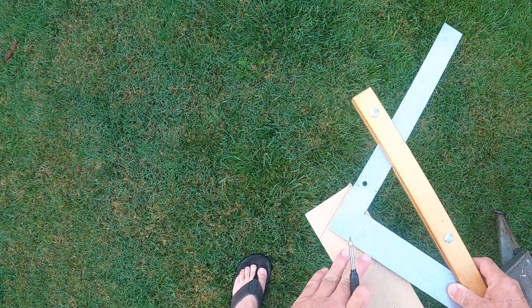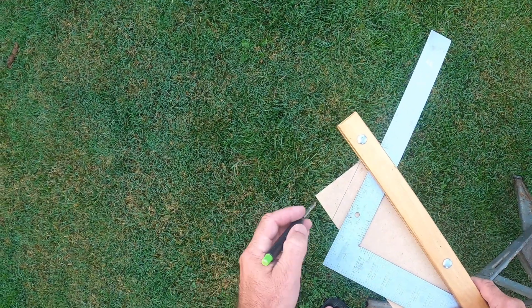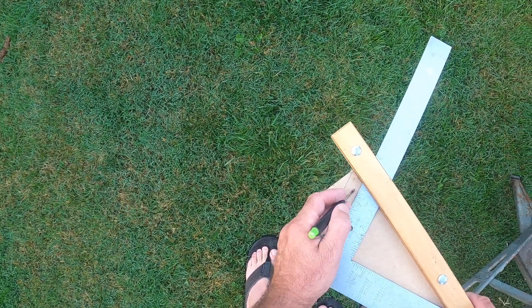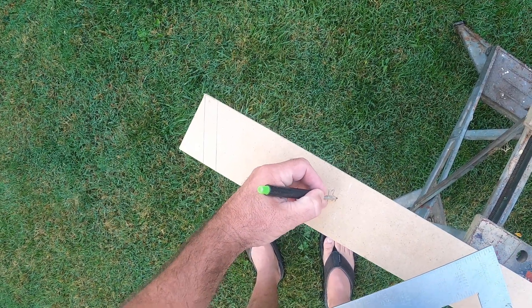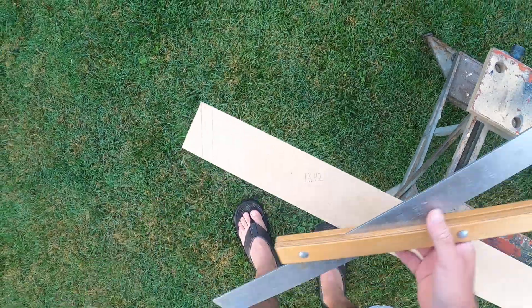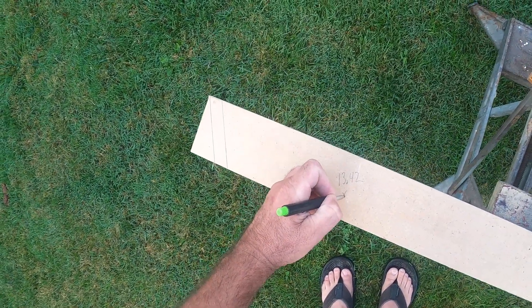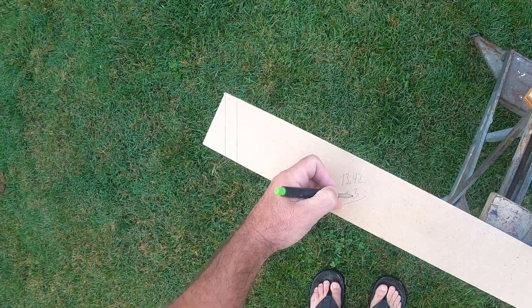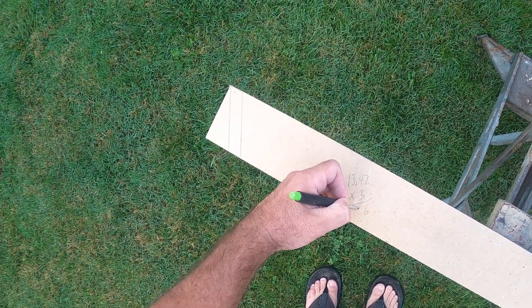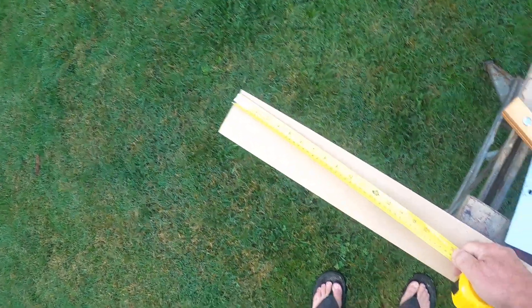Same as doing this with a speed square — you want to start at the end of your material so we can hook our tape and measure. We come over one half of the thickness of the ridge; in this case I'm coming over three quarters to represent an inch-and-a-half ridge board. For a 6/12 roof, the unit length is 13.42. I'm going to multiply that by 3 for a short rafter, bumping by your unit run — 6, 12 — that gives 40.26 inches, so I will measure 40 and a quarter.